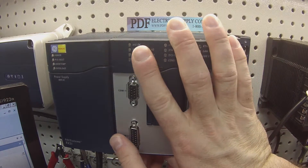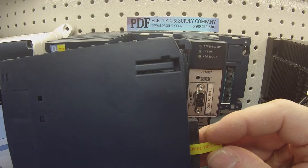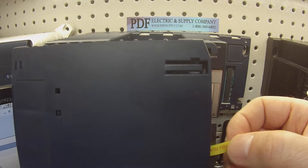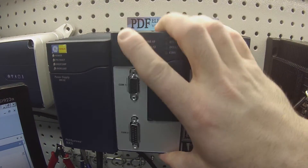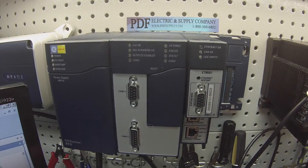One other thing I wanted to point out — I'm going to remove this from the rack and show you quickly. There's a real-time clock battery, the calendar memory battery, which is located in the back portion of the unit, unlike most RX3i processors. When you pull this tab, you activate the battery. When you remove it, the battery makes contact and engages itself. For those of you where the battery may be a concern, its life expectancy is estimated at about five years.